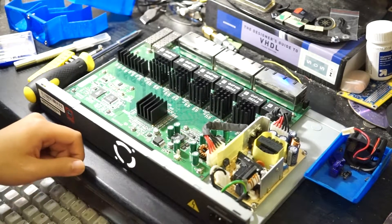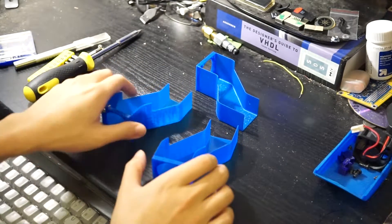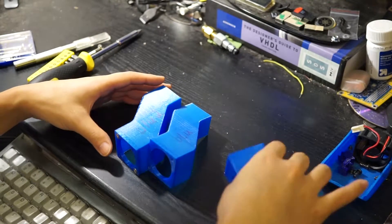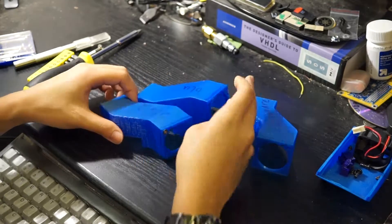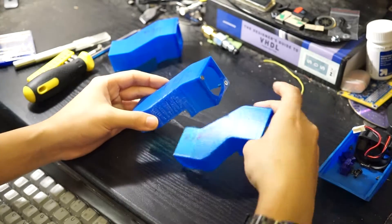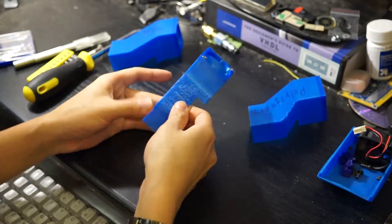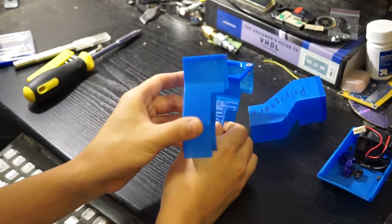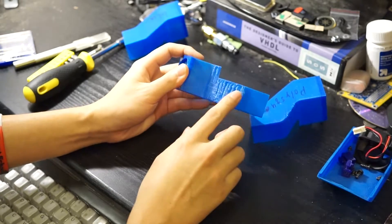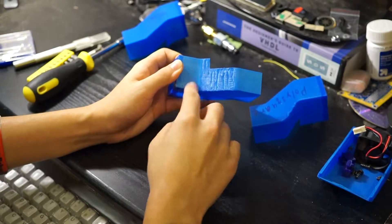Let's take a look at our 3D prints. Here's a side-by-side-by-side comparison of the 3D prints. You'll notice the second time on blue, the side that I was complaining about didn't quite print correctly. I think it might have something to do with the weird temperatures we're having here in California. I printed this in the afternoon, I printed this at nighttime, so the difference in temperature — it was quite a warm afternoon — actually made it more chattery.